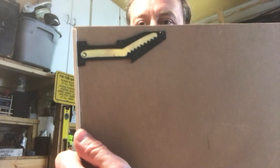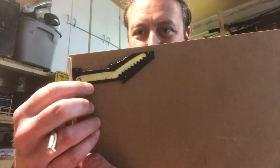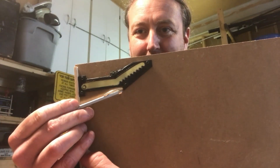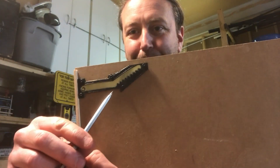What I got right here is a little 3D printed jig that I made this morning, just so I can get a better outline. This is a piece of brass — I can solder brass, so I decided to do the reverse of what I had with the thumb by printing it and just make the actual outline of it. I had no tools for metal really at all except for my drill press and tap and die set, so I had to go out and purchase a few things today: a scribe, some files including a half round file, and a 12-inch hand cranked metal shear.